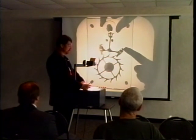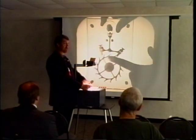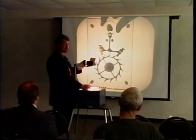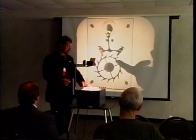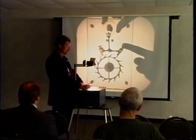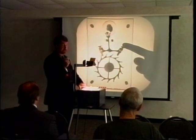So then if we were to come back to the opposite side again, say we push the L stone in. We pulled this one, correct? If we pull a stone, it affects the opposite. What it does is affect the drop locks. And so if you push the stone in, let's just talk through this one. We push the L stone in, that means that the fork slot is not going to get as close to the banking pin before the roller jewel escapes the fork slot, which means that the corner clearance is going to decrease.